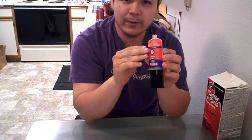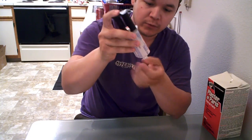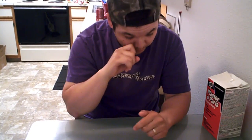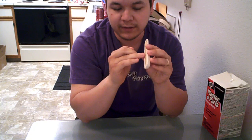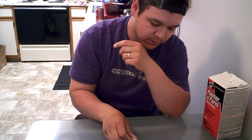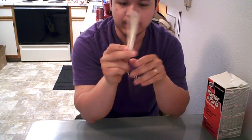What I use is paint brushes — at Walmart you can get a pack of 30 for only two bucks. They're disposable because once you get epoxy on a paint brush it's over. Pour it onto a piece of foil — it comes in two sections, one clear and one yellow. Mix it with the paintbrush and then coat the inside of your mold as fast as you can. That's going to make the inside hard as a rock, prevent stickiness, and help with not breaking. This is going to be your master mold.